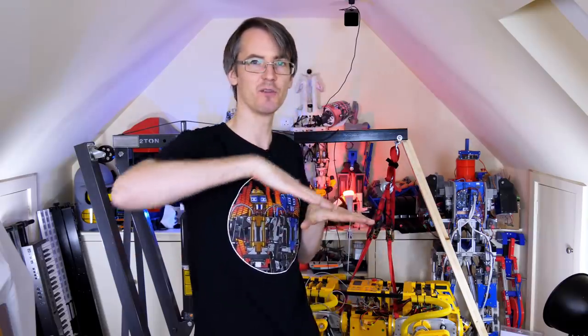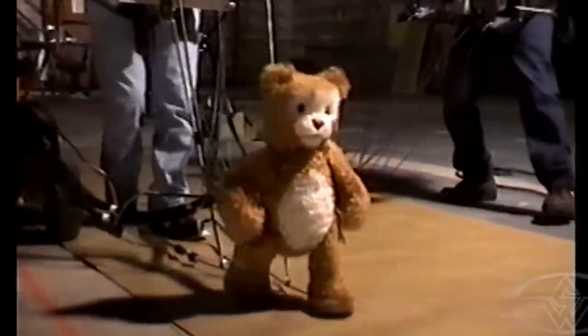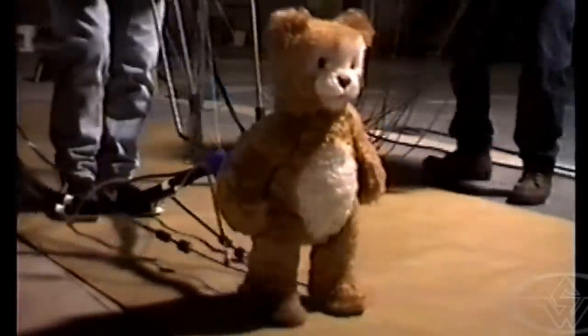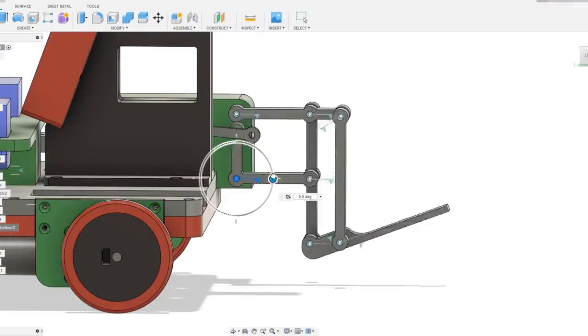That kind of works — his feet are mostly in sync with the ground, but he's hardly picking his feet up, because the toes are pivoting down as he steps, which is actually like a human. But with characters like Elmo and the original Teddy puppet, they walk in a more overemphasized character style, picking their feet up dramatically. So I've adjusted the leverage angles and moved one of the links to the front of the foot instead of the back, which now means the foot picks up in a really overemphasized way.